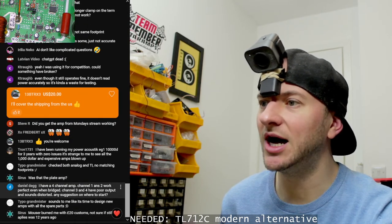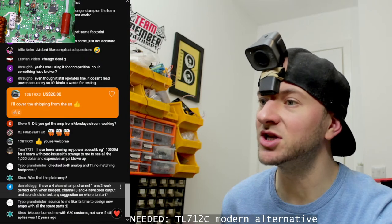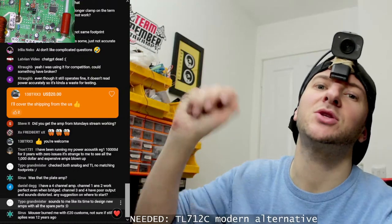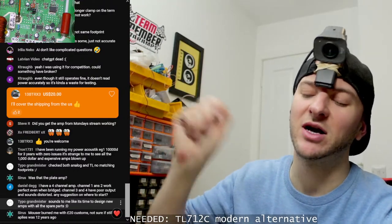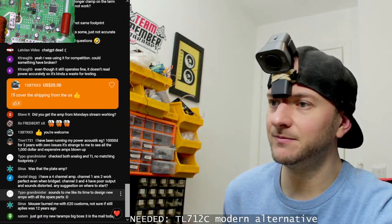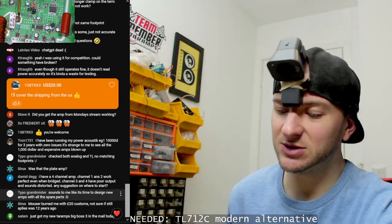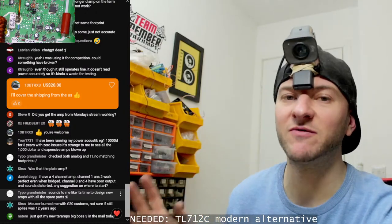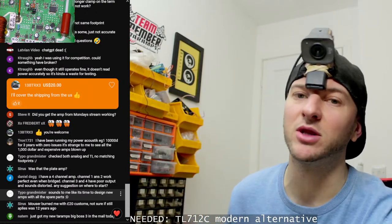Daniel says, I have a 4-channel amp. Channel 1 and 2 work perfectly even when bridged. Channel 3 and 4 have poor output and sound distorted. Clean the switches. Toggle switches. Give them a flicker back and forward. Spray some isopropyl alcohol. That's the most common issue. But if that doesn't help, then you need to pull the back off, get your oscilloscope out, and see what the sine wave looks like, because the shape of the sine wave in a Class AB will tell you a lot about what the problem is.